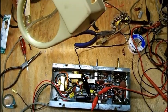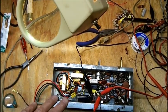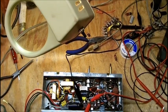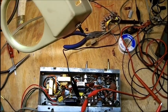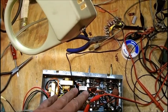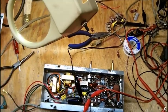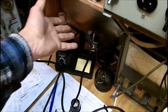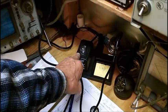And I had, as I said, a hell of a time seeing. Very, very frustrating. I came very close to giving up on this because of my eyesight. No other reason. I tried soldering on this here, and I left the soldering iron 5 or 10 seconds, and the damn solder wouldn't take. It's a cold solder joint, so I cranked the soldering station up full. Give it the max. Usually I run at a 1 o'clock position on here.